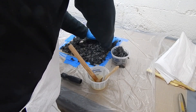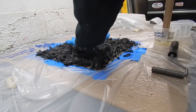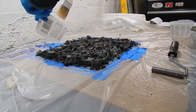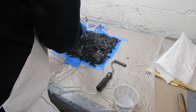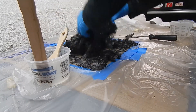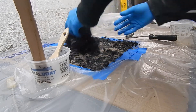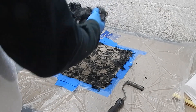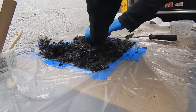It didn't really work all that well. I thought I was going to get a nice uniform layer, and this would work fine for vacuum infusion, which would be a much better way to do this, or compression molding — in which case, who cares, just mix it up in a bucket and squish it in your tool. I tried the roller and it didn't work at all. I tried mushing it around and adding extra resin with a brush, and eventually just grabbed chunks of it and tried to mix the resin in as uniformly as possible. It didn't feel wet the way a typical reinforcement ply would.